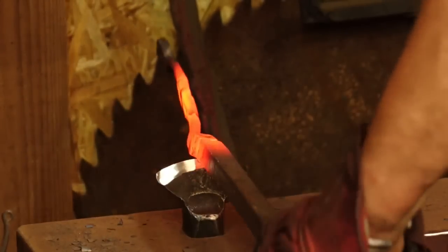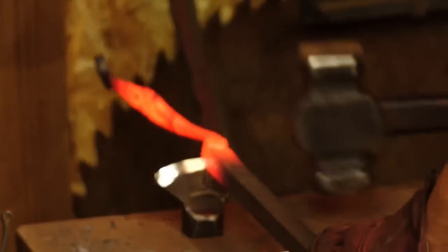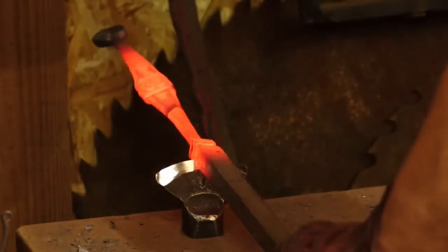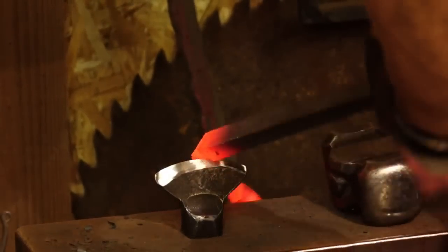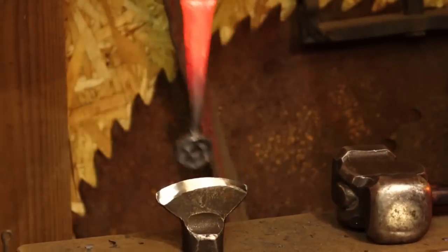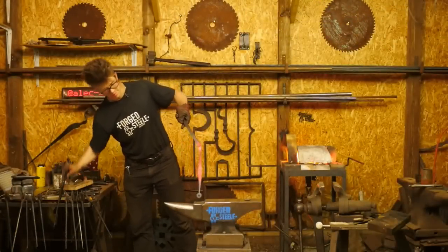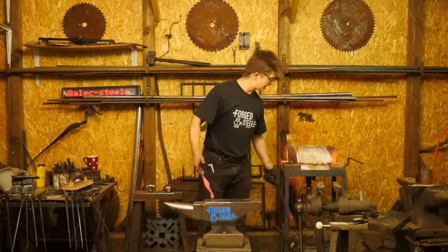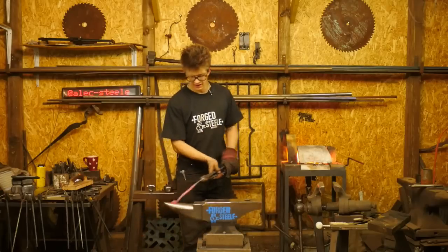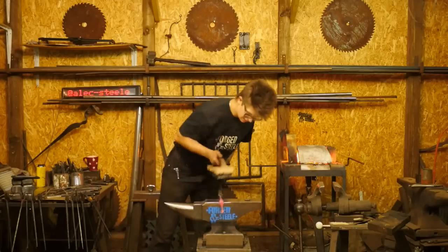I like to cut with the round side of the hammer. It's a better user experience and saves overly bending the material, something that I've explained before. There we go. There's our piece of steel. Now that's an example of a much more responsible cutting approach. You'll see that it's held onto the bar. I can easily control it and keep it nice and neat.